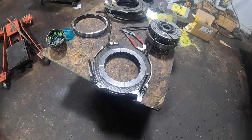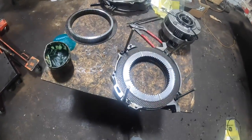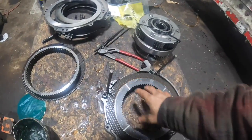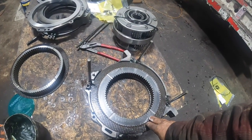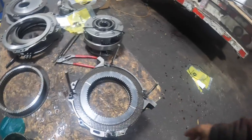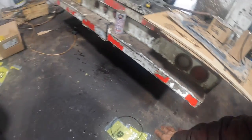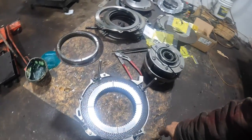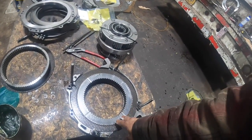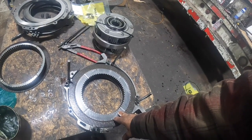Okay, so I know I didn't record this because the stupid camera battery died, I'm up to 55% right now, but anyways, I will go over an overview of what this is. B1 brake housing. So you take the piston out, they're lip seals, inner and outer lip seals, and you've got to make sure you're putting the right lip seal on, because they had different diameters of lip seals on these, so make sure you get the right size. So you put your inner and outer lip seals on, and you get your piston in, and then you're going to put your return plate over the top.